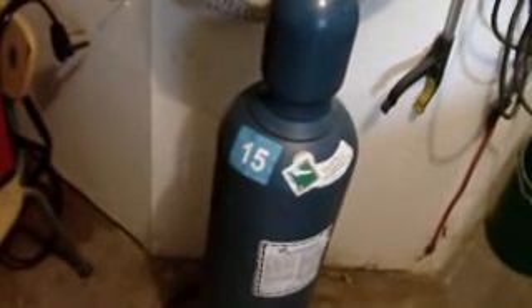This welder did not come with these bottles, but I bought them from a professional welder. This is the mix of argon and CO2 — it's the 25% mix — and that's for welding mild steel. I also bought the bottle that is pure argon, and that is for welding aluminum and I think stainless steel, although I'm not certain. At least I know what the argon was for, and I'm glad I bought both because I'd like to go on and do aluminum as well.